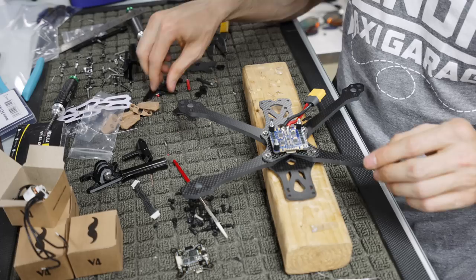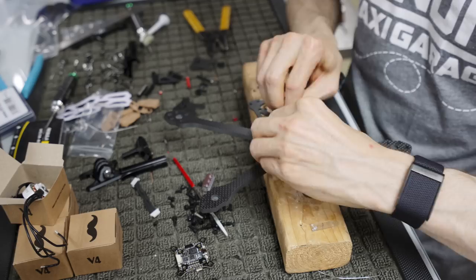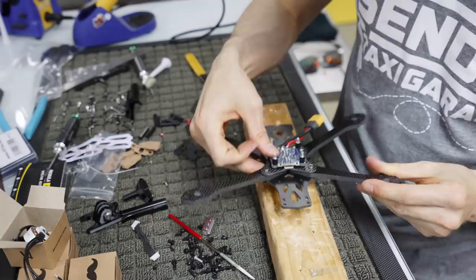And what I'm going to do now is just put them tight, and then once you get them tight, a little bit of like a quarter turn. What that does is it squishes that little donut down there. Just go back around and make sure you're tight on there. Puts a little pressure on the donut, but it also isolates, so you have a little bit of strain relief.